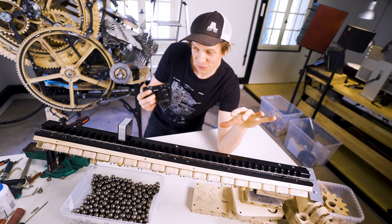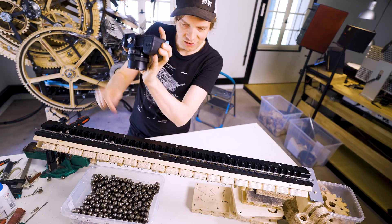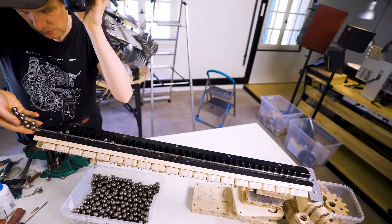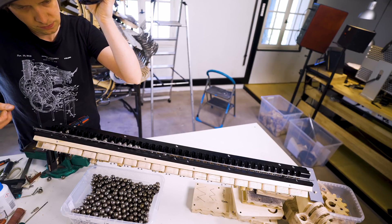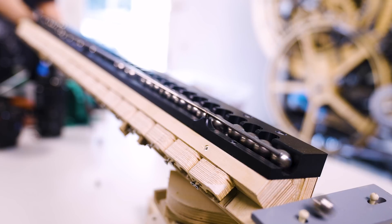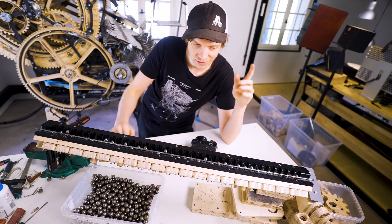I want to see when this is too fast, so I've set the angle to 10 degrees. I'm noticing something interesting — when the angle is shallower, it's almost worse because the marbles don't know if they're going into the pocket or not. First of all, all degrees worked. I had not a single failure at 25, 20, 15, or 10 degrees. It's so cool.